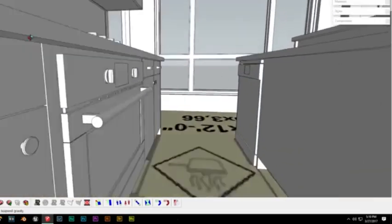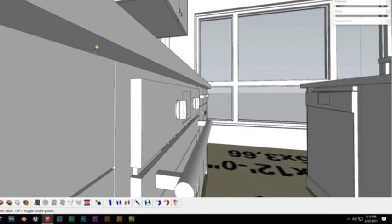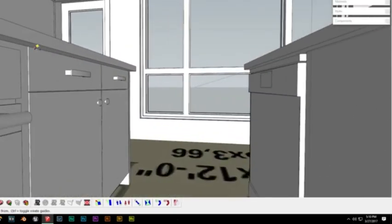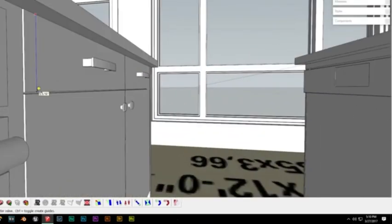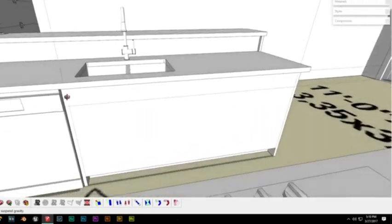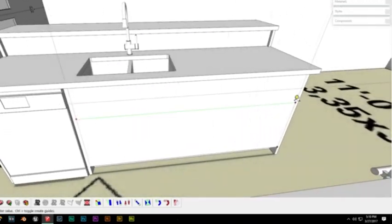And we will mimic the style that was used over on this side. So we can bring this down. Get 1/8 of an inch space from the top here. The drawers themselves were 5 and 5/16. And so now it's just a matter of figuring out how many we're actually going to have along this distance. And we have a space of 5'9".